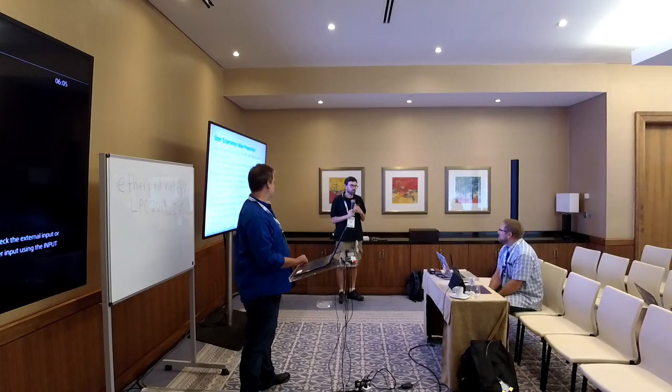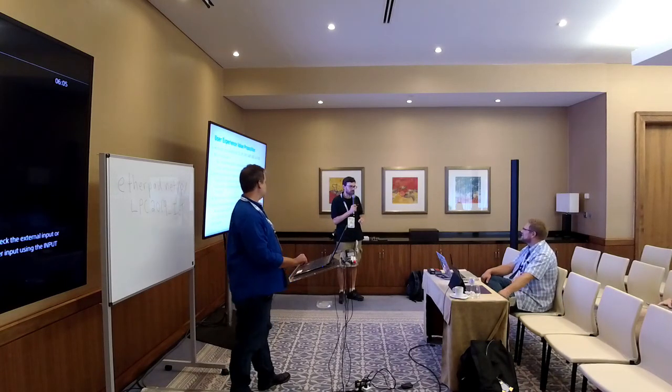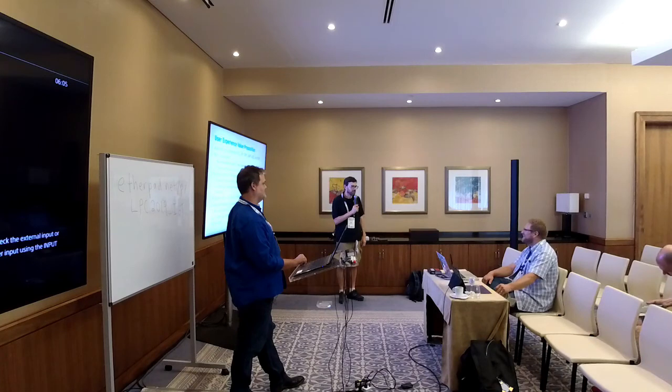I guess the point is that the developer on the Linux system doesn't need to do microcontroller firmware development, because the remote microcontroller node is presenting itself over Greybus and describing what it has, right? So, you're implementing it in Zephyr, but if I'm using the system, I don't care about that. It's a remote node that is presenting itself over Greybus.